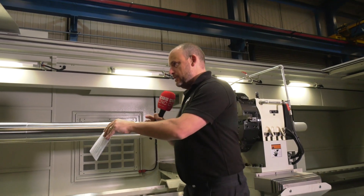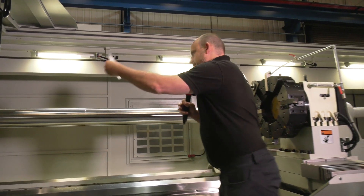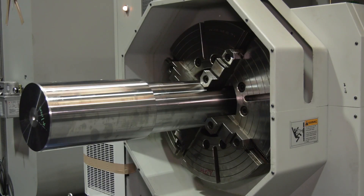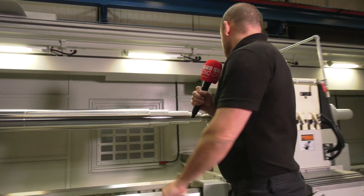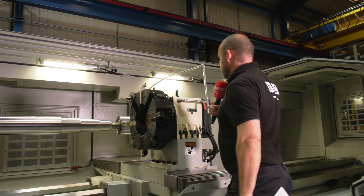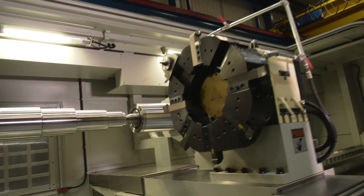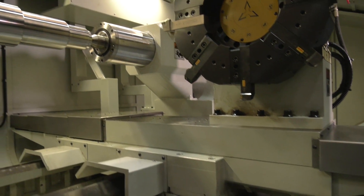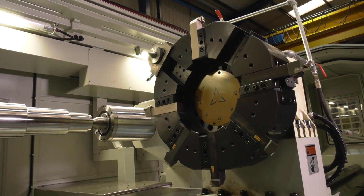The reason they've achieved it on this machine is for a few reasons. One of which is the fact you've got a double headstock — at the back of the machine the shaft is supported, buried right the way through the headstock and clamped on both sides. They've also got a very solid tailstock. Note there's no steady of course, because it's a flatbed machine — no steady to achieve the Ra value we've said. You've also got a very solid turret here as well.